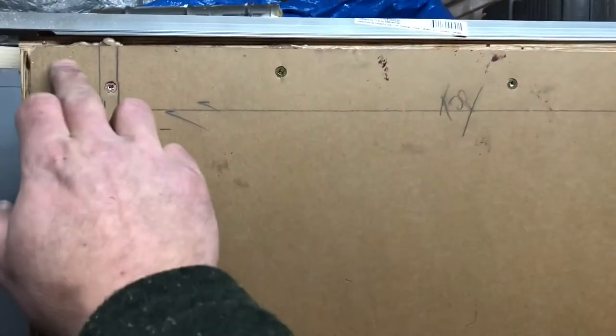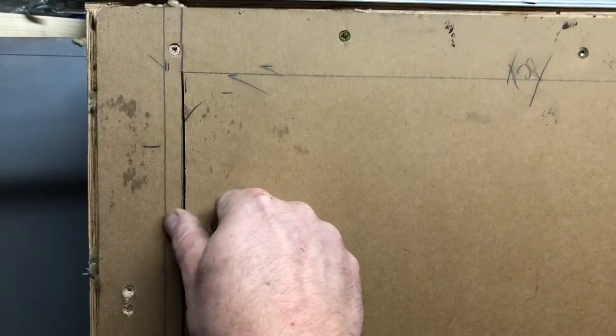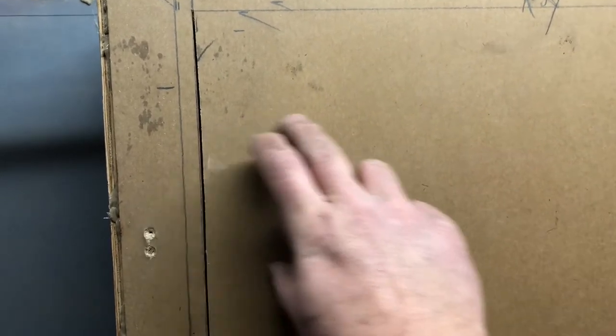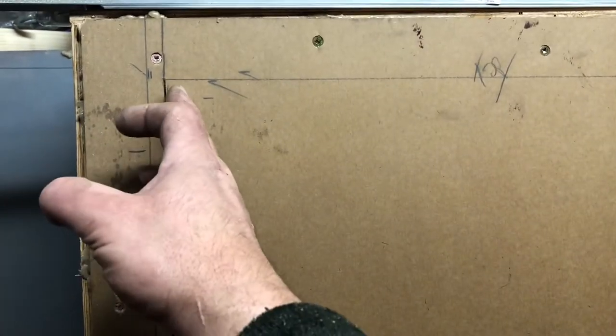It's one of those feel things, but I've been using that tool for a good decade, and hopefully you can see how straight that line is. So now I'll just go around and do the rest of them. I brought this one in a little bit because of the size of the hinges I'm using. I'll put some backing in here when I get to the corner, and obviously I'll get my hand saw to finish all that stuff up. That's kind of where we're at — we're going to cut the door open and get this thing going.